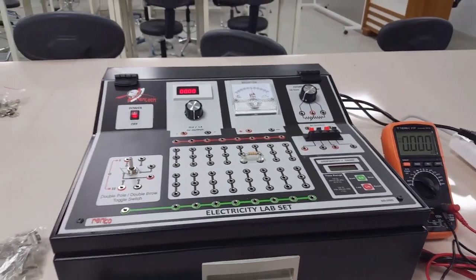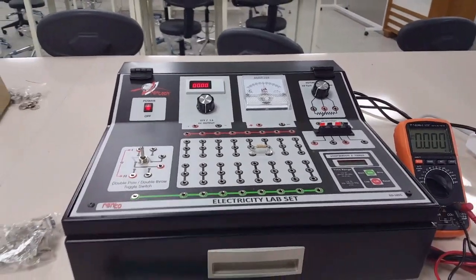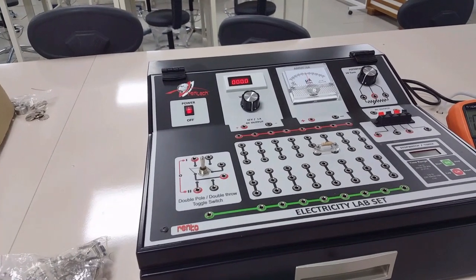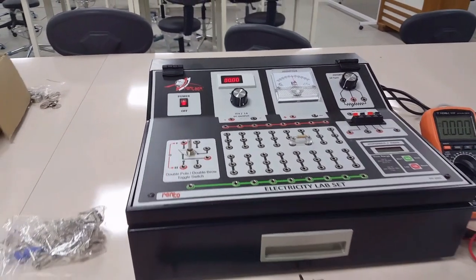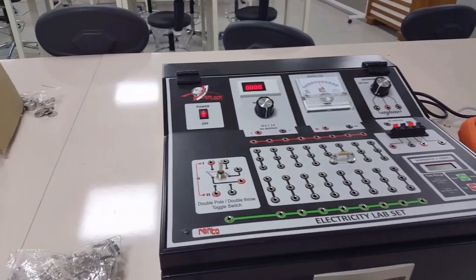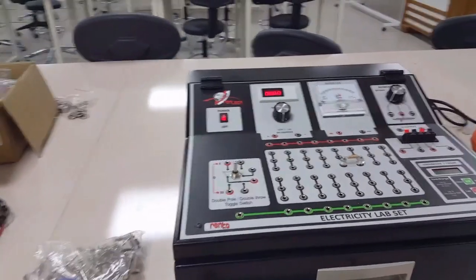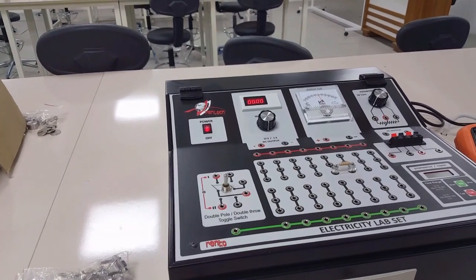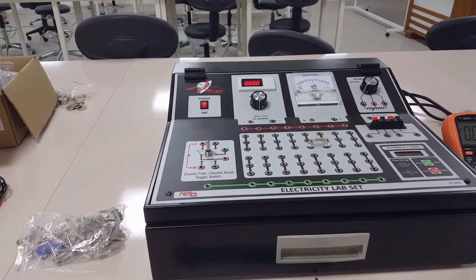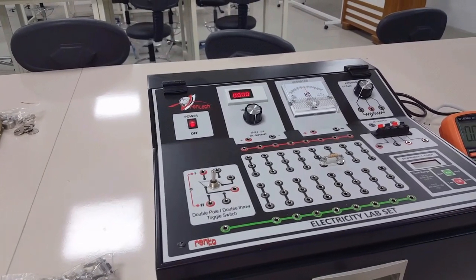If we talk about the operational rules, ammeters are generally protected from excessive current by means of a small fuse located inside the meter housing. If the ammeter is accidentally connected across a substantial voltage source, the resultant surge in current will blow the fuse and render the meter incapable of measuring the current until the fuse is replaced. So we will be careful to avoid this scenario. You may test the condition of a multimeter's fuse by switching it to the resistance mode and measuring continuity through the test leads.